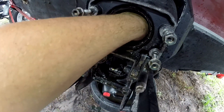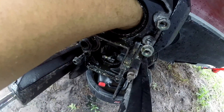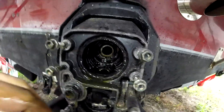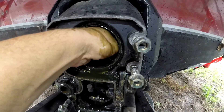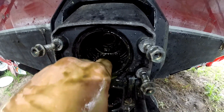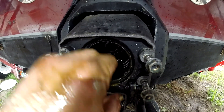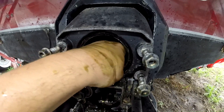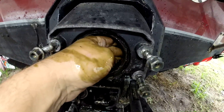Here's another piece — this is what was in there, just beating around, and this is probably what ruined that seal. Here's another one — so this has to be some kind of a retaining clip or ring. The bellows has rings around it that keep it in shape when it goes up and down. I think the engine was started with the drive all the way up by accident, and the universal joint grabbed one of those rings, broke or bent it enough to dislodge it, and then from just running the boat it got chewed up in that universal joint.